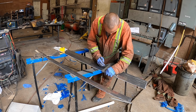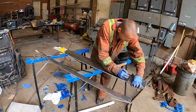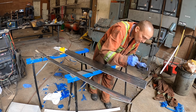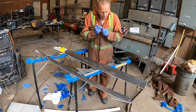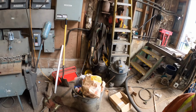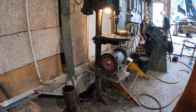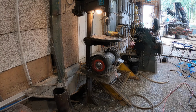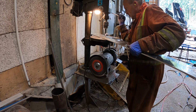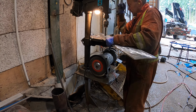So the idea is I put the 1 inch crown into the deck, so I just calculated out the angle that's required for a 1 inch crown over, I think it was 9 feet at that point, because it's a 10-foot beam at the widest point. So I calculated that out, and then I had them put a bend in that to match that crown, and then I took the 2 inch piece and I had them bend that to the same crown. And then what we've done is, this plate was a little bit short, because we only had 8 feet of plate, so it's like 9 foot.